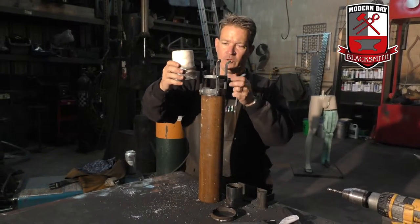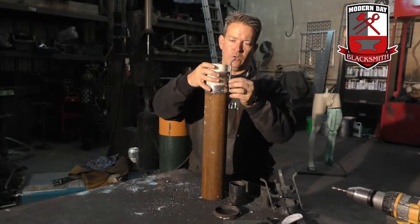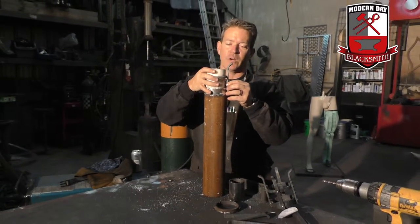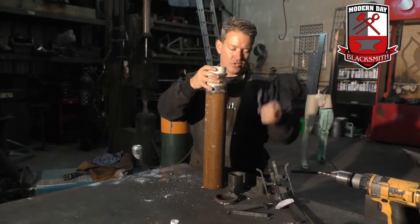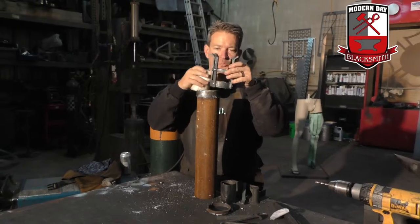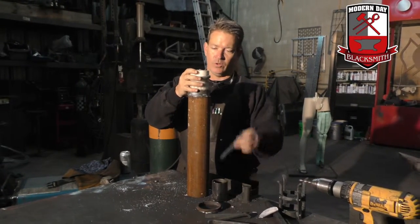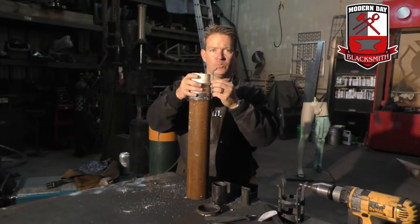There's actually a whole lot of little pieces that go in this. You put that on there, make sure you find it and quarter it up because it won't look right if you don't. I chose an inch and a half between the two, so I put a piece of inch-and-a-half pipe or square tubing on it, then welded all my pieces and ground it up, and there you go.